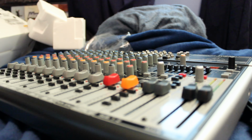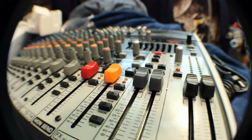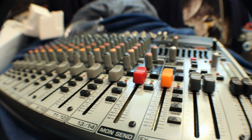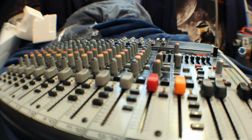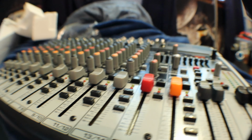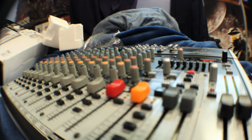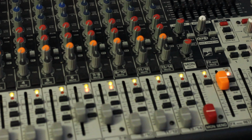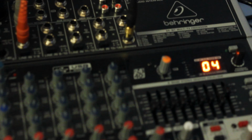So you've got 6 mic inputs with XLR or 1/4 inch, channel inserts for those inputs, allowing you to route them to separate effects processors and back, then 8 more inputs lined up as dual 1/4 inch inputs for stereo or mono via the left channel. The 6 mic inputs have a gain knob for the preamp and a built-in compressor knob. All inputs have a level adjustment pad for +4 dB or -10 dB. All inputs also have all of these other knobs.